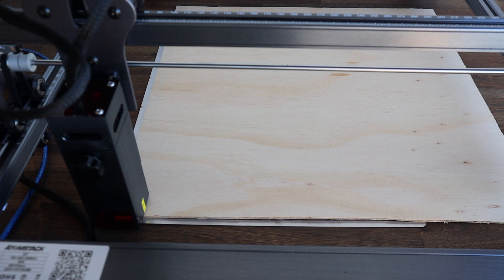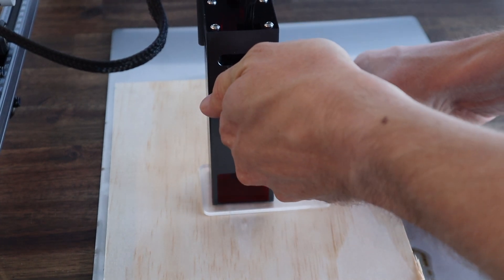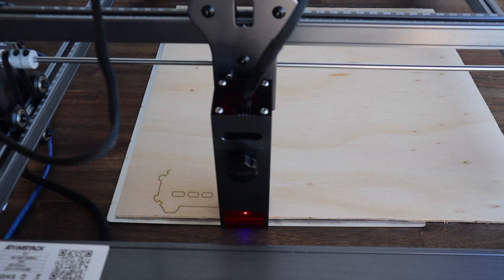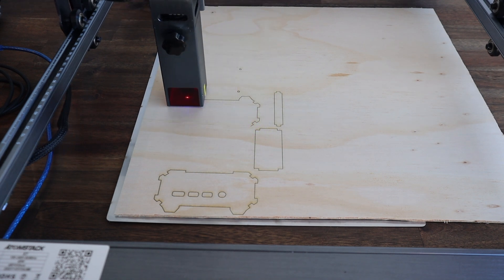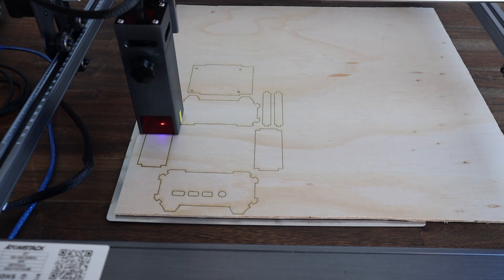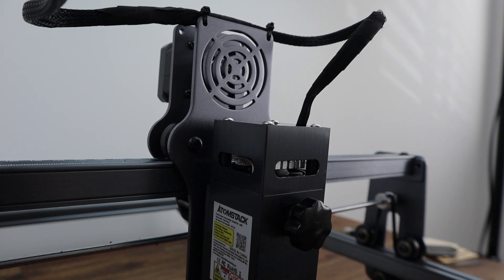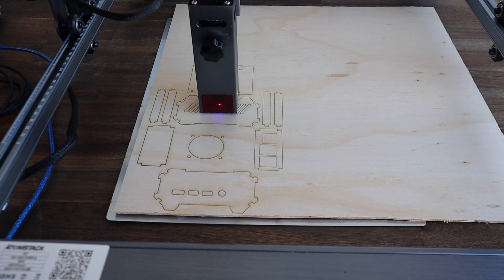Cutting is pretty simple once you've got the hang of it. You'll need to remember to adjust the focus of the laser to suit the material you're cutting — this is easily done with a single thumb screw on the front of the laser module and a small piece of acrylic between it and the material. You'll also need to use a fan or work in a very well ventilated room, as one downfall of these open designs is that the smoke just goes everywhere. The laser module does blow air away from the immediate area being cut, and the internal cooling fan exhausts out of the laser end, which helps keep the lens clean and keeps smoke away from the cutting area.